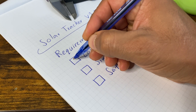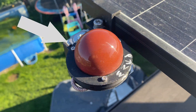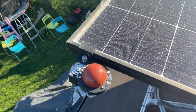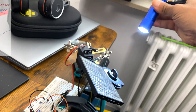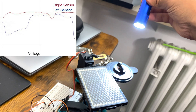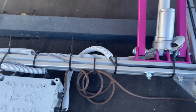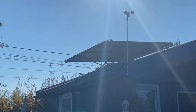But it's not just about moving the panels — I wanted the tracker to think too. I used two photoresistors that detect sunlight direction and send signals to the microcontroller, the tracker's brain. This lets the system adjust itself automatically, following the sun all day. Two photoresistors sit in a 3D printed holder — they're like two sunbathing siblings separated by a little wall. When the sun hits one side more, the other one gets jealous and increases resistance. Literally. The tracker measures that voltage difference and tells the motor: move the panel so everyone gets equal sunshine. It's like the ultimate sibling rivalry solution.